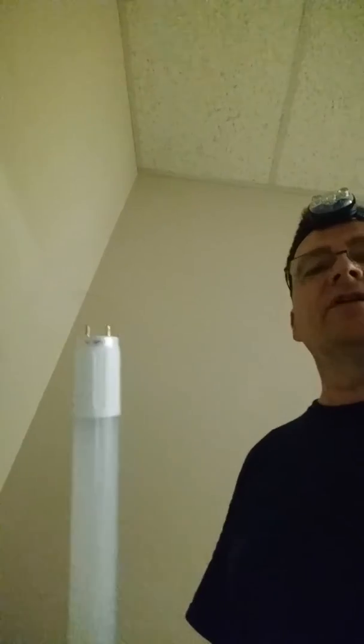If you look at this, it actually has one side that says voltage in or AC input. This is the side where we're going to connect the neutral and the 277 to. So what we're going to do is just put in 2 of the bulbs. So what we need to do is identify the wiring.